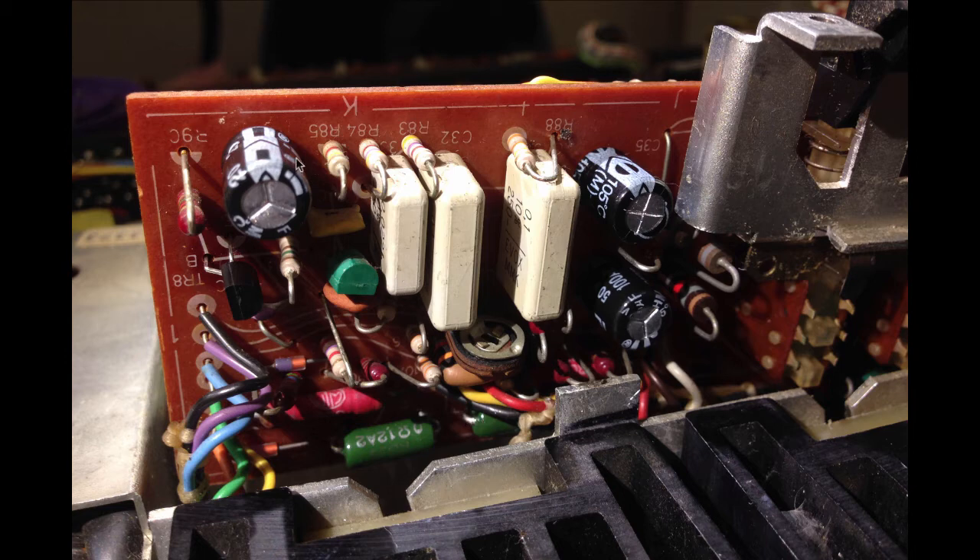You also see the new electrolytic capacitors. I also elected to replace the transistor TR8 that drives the push-pull stage, because I was afraid it may have briefly exceeded its voltage rating of 35 volts — the old BC332. I had some 2N2222 NPN transistors lying around and they are a little bit beefier, so I put this one in here just to make sure we don't have a compromised transistor in the circuit.